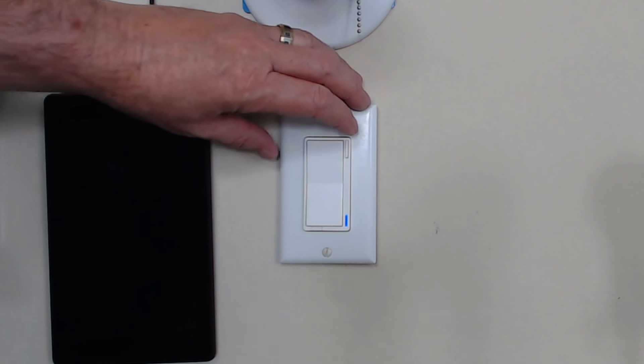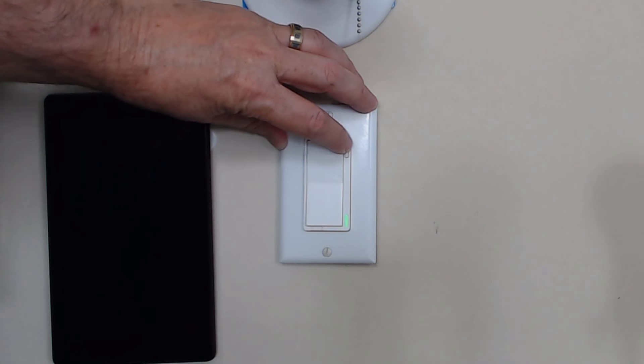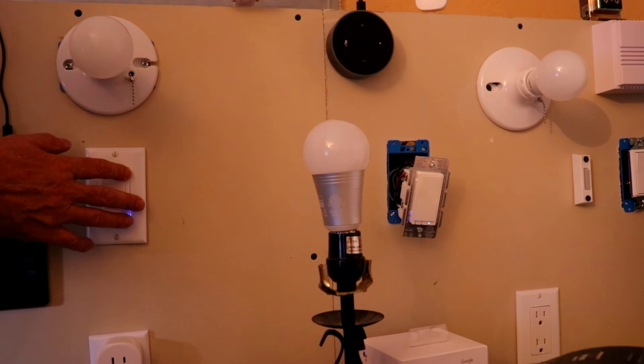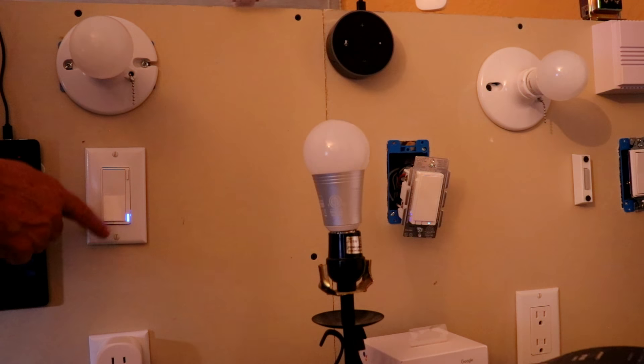While we're on the configure button, it's more than just a scene button. Hold the button down for somewhere between five and 10 seconds, and the LED turns into a signal strength indication — a great feature when you're trying to pair the switch and need to know if you're in range of a proper Z-Wave signal. And if you tap that same button eight times, it disables the internal relay — better stated, it disables manual control of the relay from the switch. Not sure why you need this? Well, that is the very subject of my very next video. Stay tuned for that.